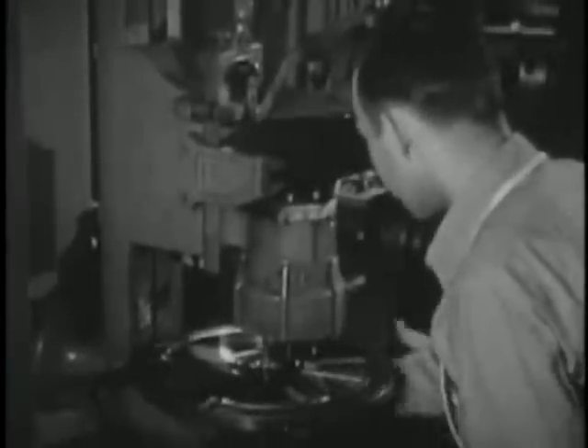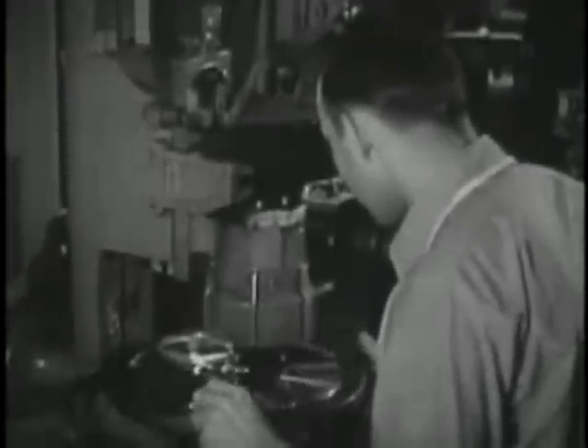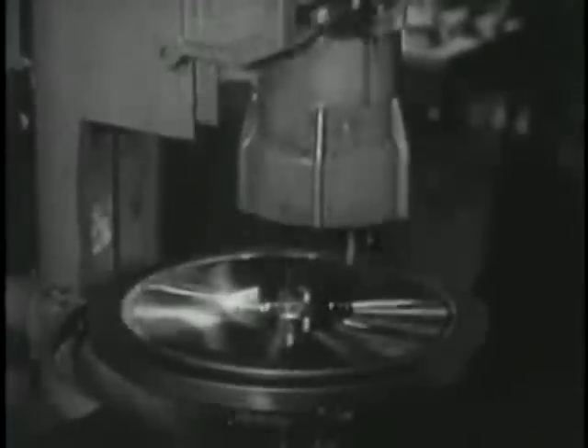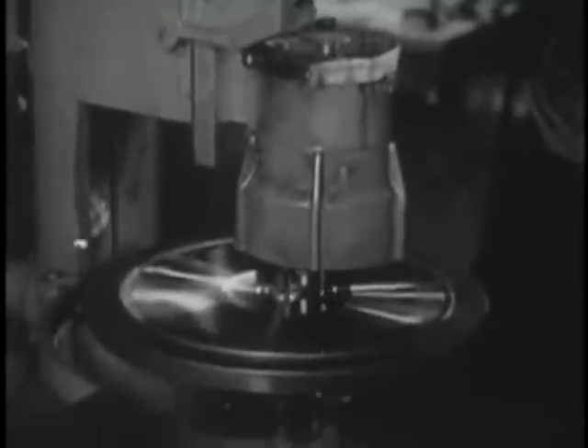Looking through the magnifier, I saw the rotating grooves of the music itself caught on the record. Carefully the technician centers the disc and with the lens he checks again. With the position of the hole accurately determined, he drills it with infinite accuracy on dead center.